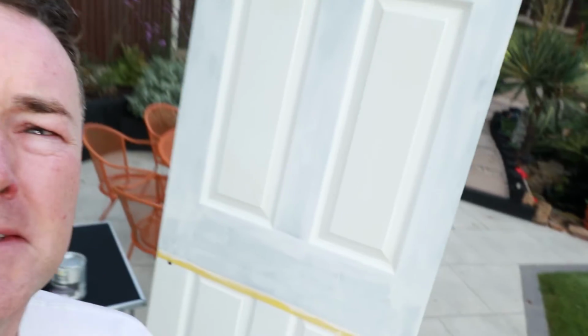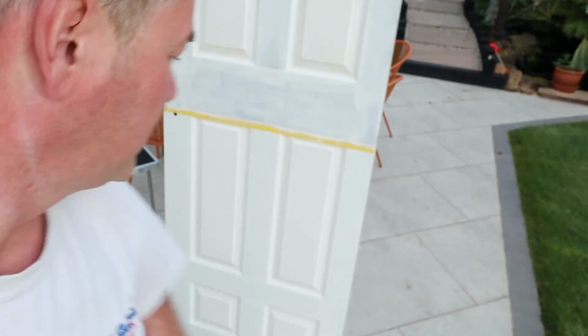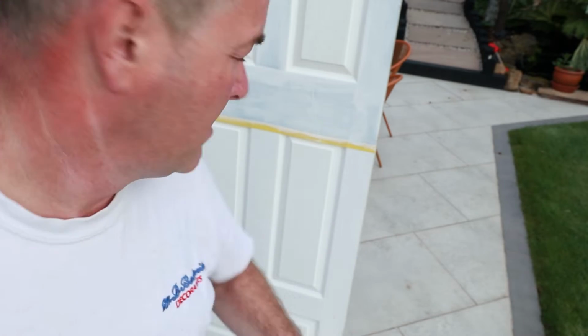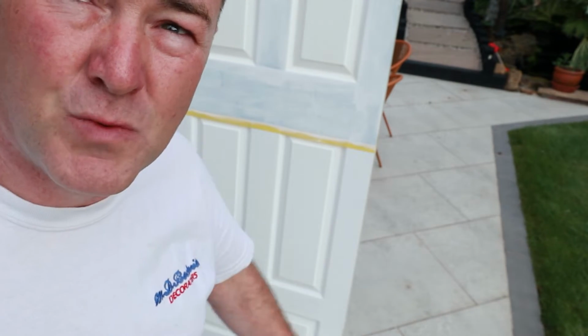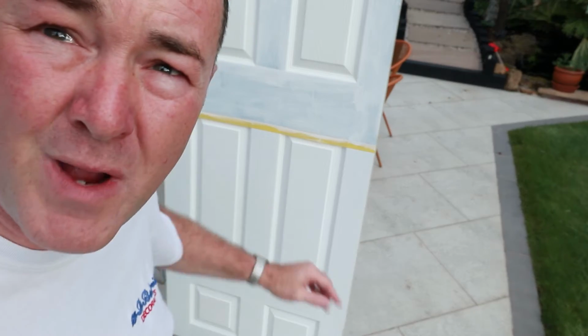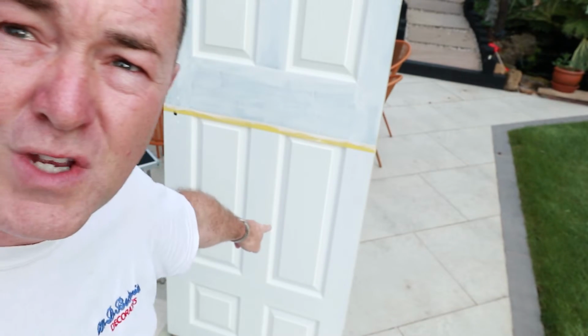Whereas, because we're comparing this against the Benjamin Moore Scuff X, if we can just get you back down and pan you down. The Scuff X under here has had two coats over the same base colours, as you know. Now, that does look like it has covered, but I'd probably give it a third coat because we've gone over such dark colours. The cream's fine, that's covered for two, so we're quite happy with that. Over the blacks, as we all know, we need an undercoat primer, but on the whole for two coats that's good.